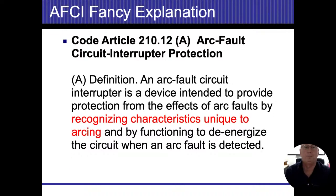All right. Arc faults and arc fault circuit interrupters. First thing I think before we talk on these, it should be known that the city of Chicago is not mandating that arc fault circuit interrupters be installed. Most of the suburbs, at least I'm not aware of any of the suburbs in Chicago or any place else in the state of Illinois. And, you know, I hope you understand, I do not know every single code in every single part of this state or country. So if some of them are following suit of Chicago, that may be true. But not everybody, or the city of Chicago itself, does not require arc fault circuit interrupters.